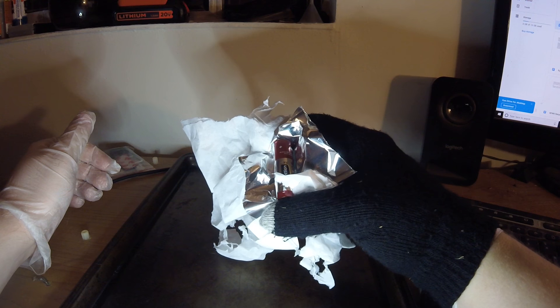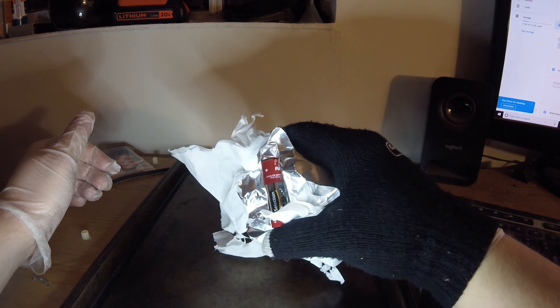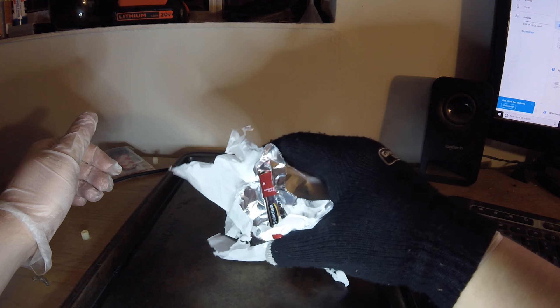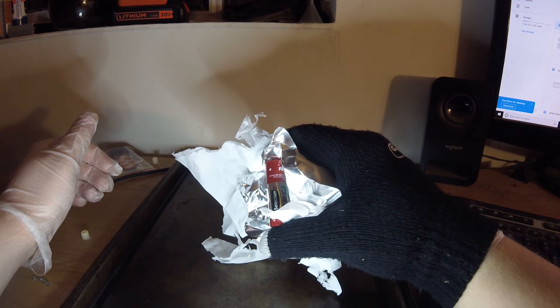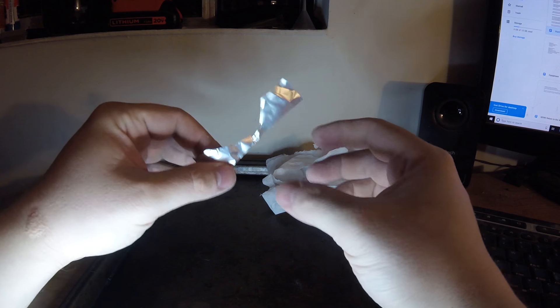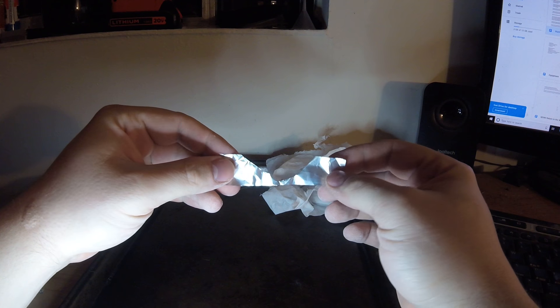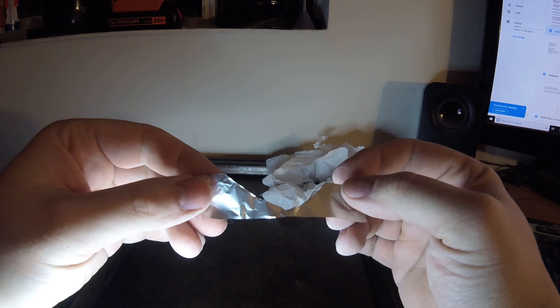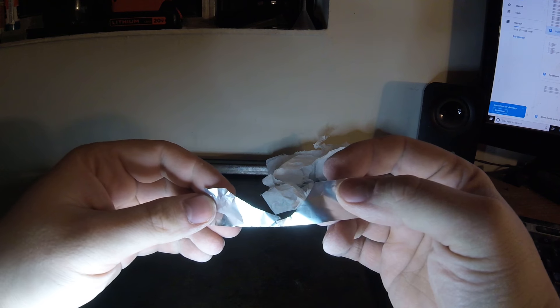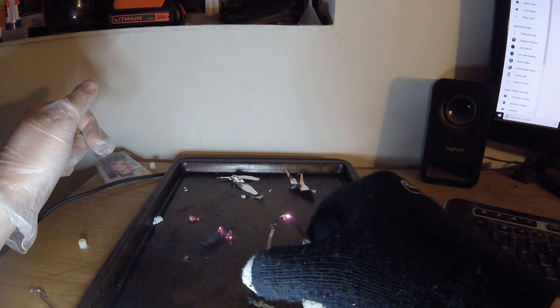The hard part comes next. With the electricity concentrated through such a large piece of foil, there just isn't enough heat being generated by resistance to do much of anything. What we need to do is to choke the electricity through a thinner part of the foil, focusing the flow, and as such the resistance, to a much thinner area. When you do this, you've essentially created a heating filament. Watch as the aluminum foil glows red-hot where we've thinned it out.